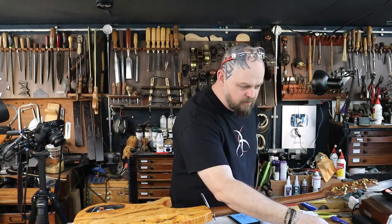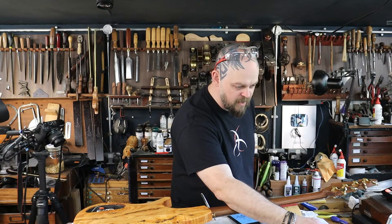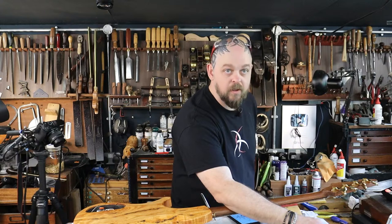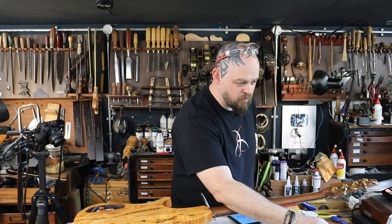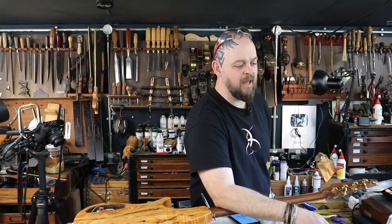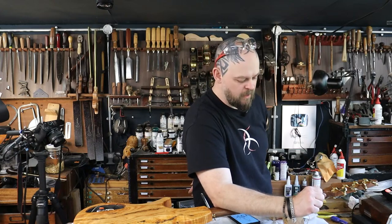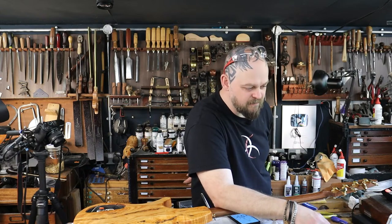All right. Simon Duffy says, ash as a neck wood, any good? Also, I've seen you use sycamore before. I have a few kiln-dried slabs of it. I use sycamore all the time. Sycamore is great. You are going to be happy. Just double check that it is dry enough. Ash as a neck wood, I tend to avoid open grained timbers where I can for neck woods, and that's particularly open grained. I do think it would be strong enough, but not too sure.